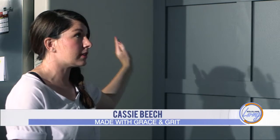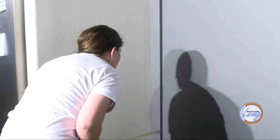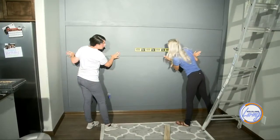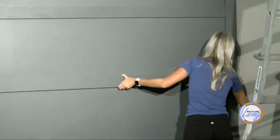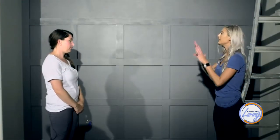Next step was installing the trim boards. We added all the exterior boards first — the sides first since they were the tallest, then the top and bottom. Because there was an odd number going up, it was easier to visually find the middle board and divide from there. Throughout the whole process, we carried a level to make sure boards were on the correct marks and not accidentally shifted, since any offset is very visible in a grid pattern.